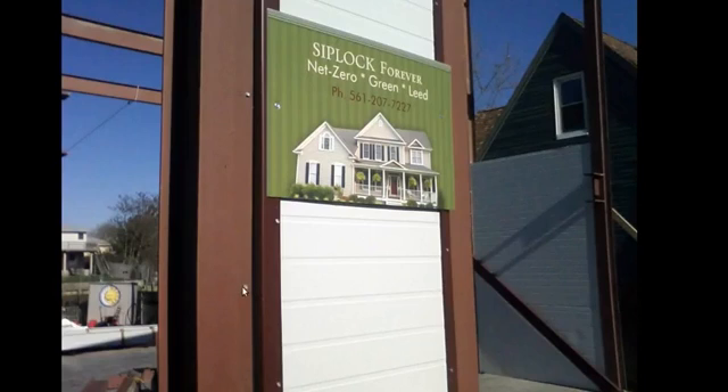These screws are going into this clip — the clip is under there. Also understand that these columns have an inch to inch-and-a-half face of insulation that goes over the column. So there's really no bottom plate, no header, no top plate. The columns are insulated with an inch and a half of foam board in front, so there's no thermal bridging in the system at all.